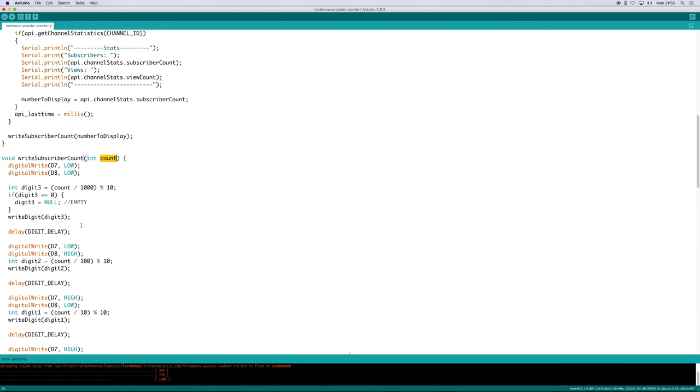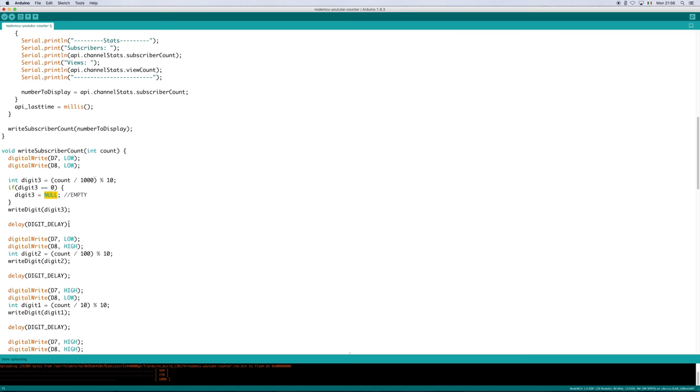As we did in earlier examples, we count from 0 to 3 on the pins connected to the demultiplexer inputs. We take the subscriber count, divide by 1,000, and get the modulus of 10 to get the most significant digit. I've less than 1,000 subscribers, so this number is 0, and we just show blank.